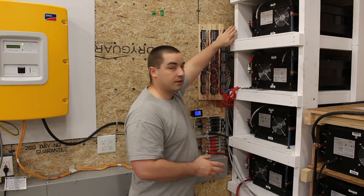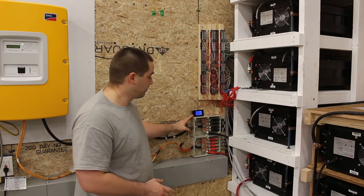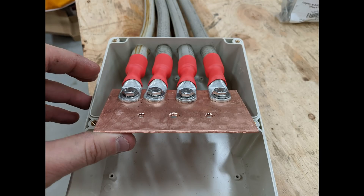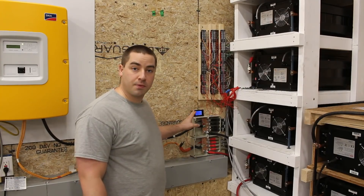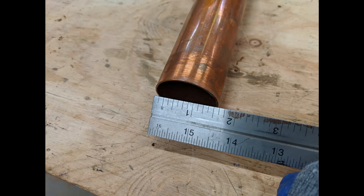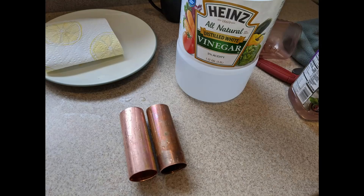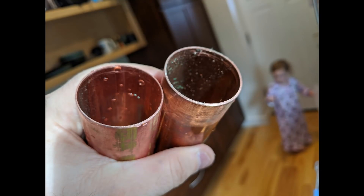All of the fuses come down behind the rack to a central point — my bus bar location. I have two plastic boxes with holes drilled in the sides for the cables to run in, and I attached them to a bus bar. I stapled all the cables to a block of wood to keep them positioned. The bus bars are actually 1.5-inch copper pipe that I pulled from a dumpster. I soaked it in white vinegar and table salt to clean it up, then brushed, washed, and cleaned it some more — they came out looking really nice.